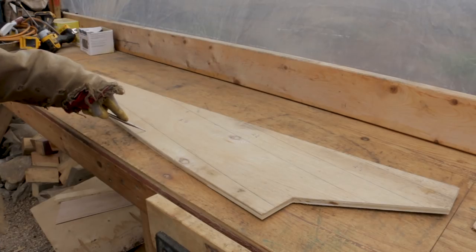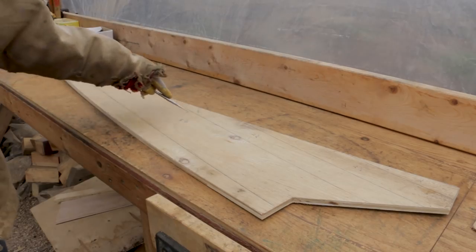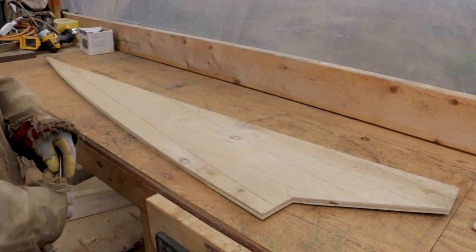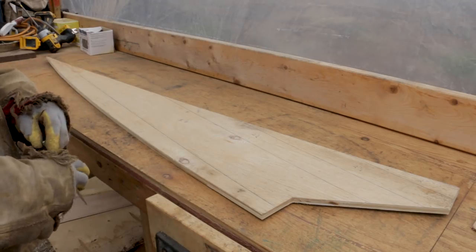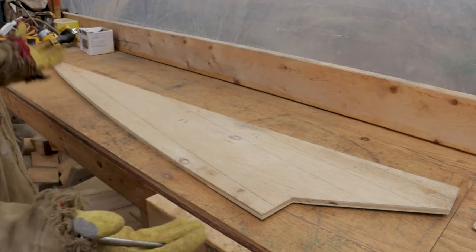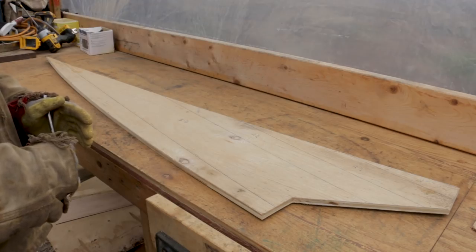Here we have the fore deadwood. I did basically the same process as with the aft deadwood — fit in the two-and-a-half inch thick worm shoe, put on a five-and-a-quarter inch timber, then added some two-and-a-half inch lifts to make up the rest. The fore deadwood is not nearly as structural as the aft deadwood, so this one is simpler and easier. Not super worried about strength — just keeping the worms out and making sure we have a nice fair piece of wood in front of the ballast keel.